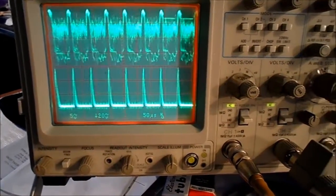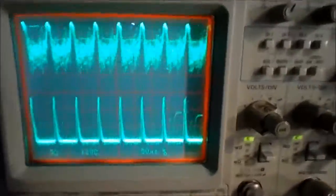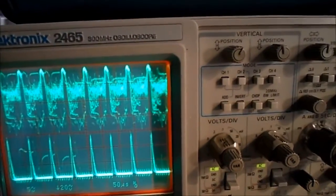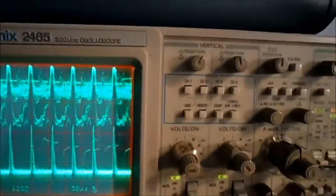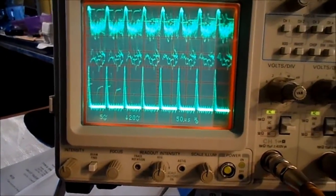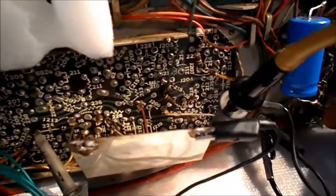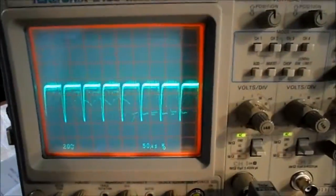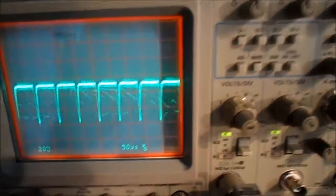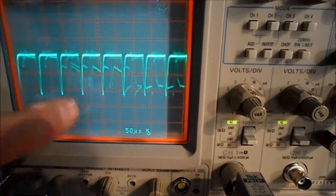I'm back on the Magnavox. I was trying to mimic what Dave W.M. is doing — probes on pin 2 and pin 3 of the sync separator tube. I had to invert this one. I'm on the grid of the sync separator with V9 pulled, on 2 volts per division. I know it's inverted, but there's my pulse — just under 6 volts peak-to-peak.